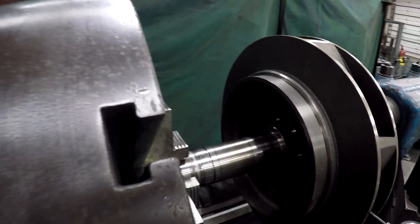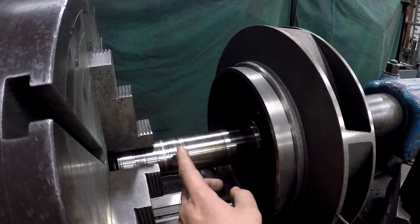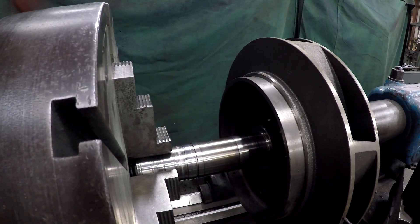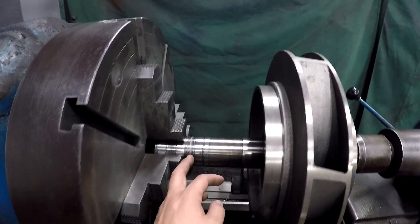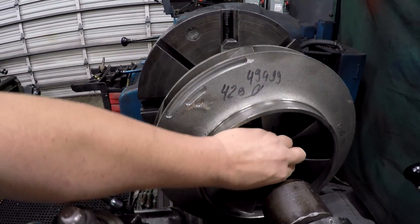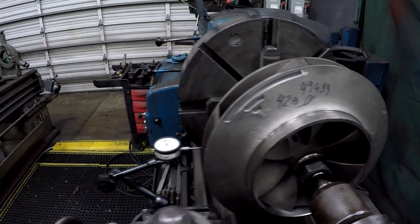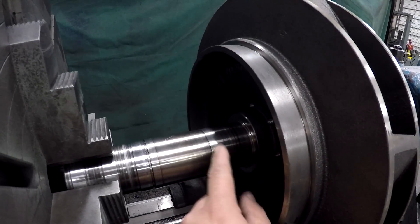What I've done is I'm using an old shaft as a mandrel — this is an old pump shaft that's good on one end but just had a bad bearing fit on it. I cut it off and I'm using that as the mandrel here to save a little time on the setup. I've still got to tighten up the nut — I don't have it fully tight yet — but I've put a center on one end and I've got it running zero right here.